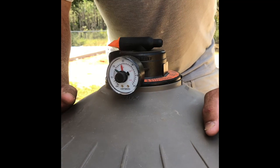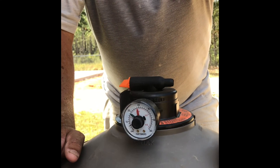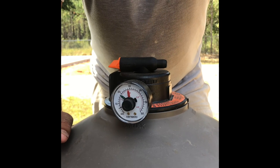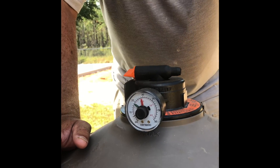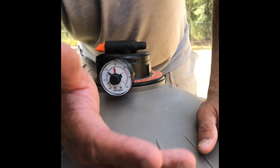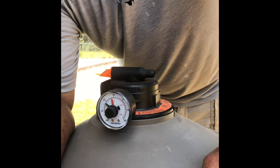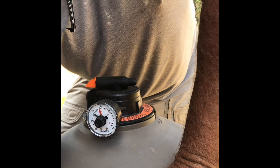This thing right here will last a long time. If you let it get out of hand and don't take care of them, they're $800 to replace just the four filters in here. They're not warrantied if they're dirty — they're warrantied if something malfunctions. So about every six months — change the filter. What I do on mine is right before the swimming season in early spring, I clean them then. And then when the season's over, around October or November, I clean them again. So you just have to clean them. If you'll call the office the first time when you hit that window, I'll come out and show you how to do it. I'll do it with you the first time.